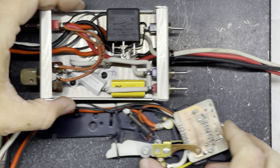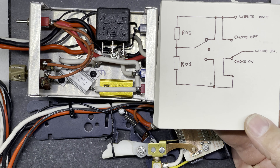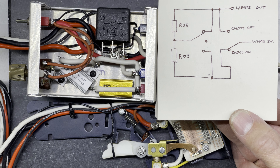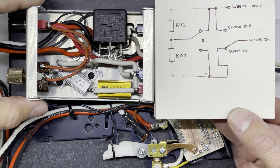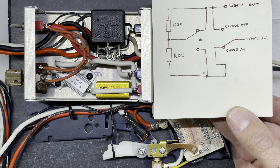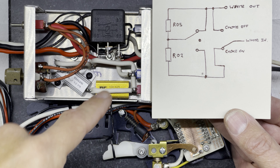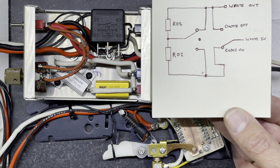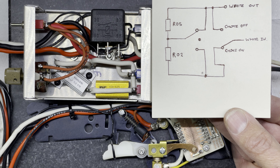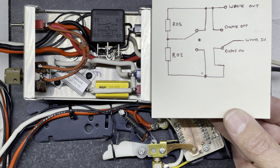I hope you enjoyed that - how to fit a choke. The circuit diagram has been on the screen. Fairly simple, fairly neat job, and that gives you three levels of choke. Obviously if you didn't want three levels you could do it more simply with just a single switch and one resistor, but this gives you a good choice of different levels of resistive choke for your car. So we've added a full power relay in the past and we've now added a choke system. What's next? We might be coming to the anti-brake, so stay watching for next time. If you haven't subscribed already, hit the big button. Have a look at my other videos and we'll be back very soon for the next modification. Bye!